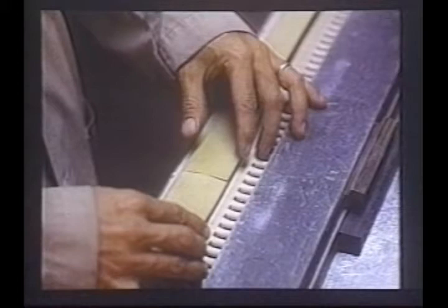Our dampers, made from premium French wool, are glued to hard rock maple heads. The wool units are cut to fit single, 2-string, and 3-string unisons. If not dampened, a string will continue to vibrate. That should happen only when you want it to, and is controlled by the pedals.